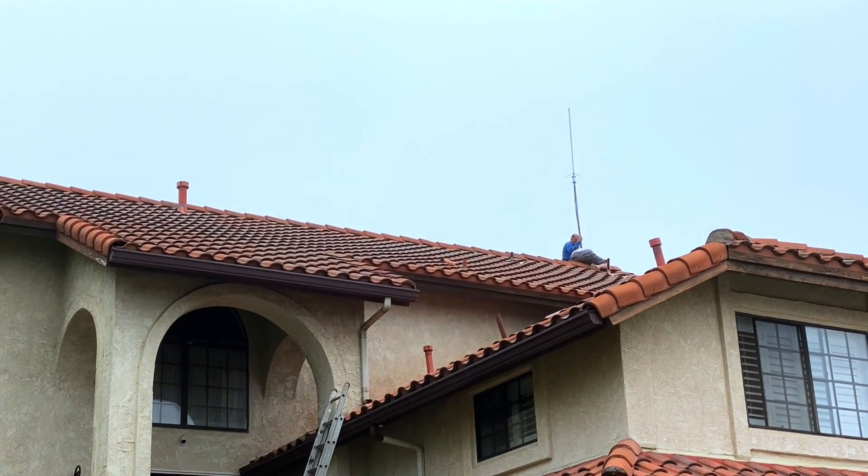So I got a small Yagi antenna that's directional, because I don't care about what's behind me — I've got mountains behind me. I figured I could mount it facing the area that I want to cover. It's got a fairly wide pattern; it's not too directional. So I put that at the front of the house. I've got the big antenna up in the air on the chimney at the back of the house, and with that combination it actually works pretty well. Because the two antennas are separate, I can adjust that Yagi antenna in the direction that I want it. Normally a directional or Yagi antenna wouldn't be the best idea, because generally you want to send and receive all around you. But in my case, I don't care what's behind me. I can receive in the front, and I have that transmitting antenna behind it so it's not desensing or interfering with the receiver when it's transmitting.